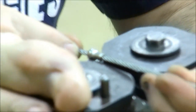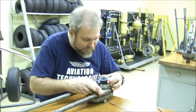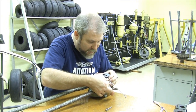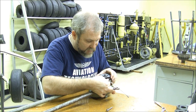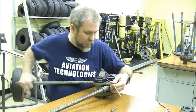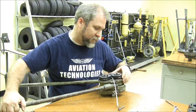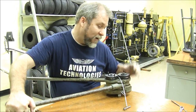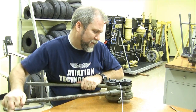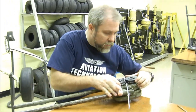On the other style, we rotated it 90 degrees and did it again. On this style, on a ball, what we do is we reset the shank. We reset it into position number two and we do it again, but we leave it 90 degrees offset from how we did it in the last one. Pull it in as much as we can, bring our handles out and swage it for position number two. This is taking a lot of force because this one is actually swaging the ball down quite a lot smaller, as well as the shank. And we've just gone ahead and done our second swage.